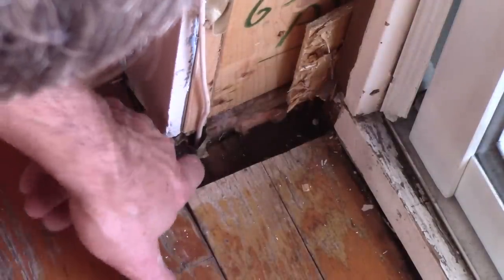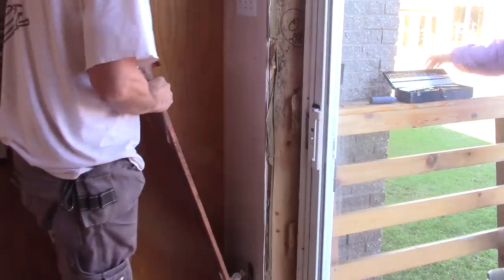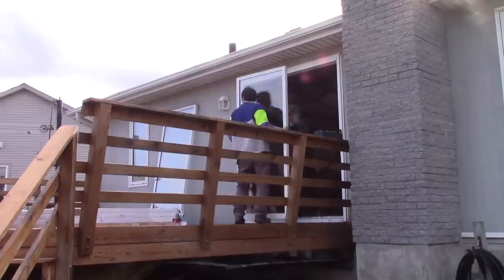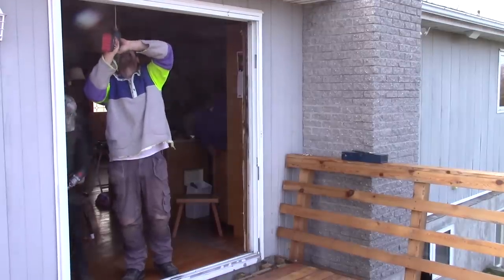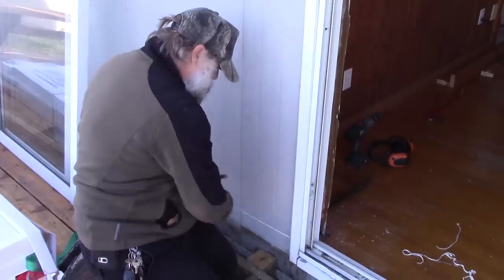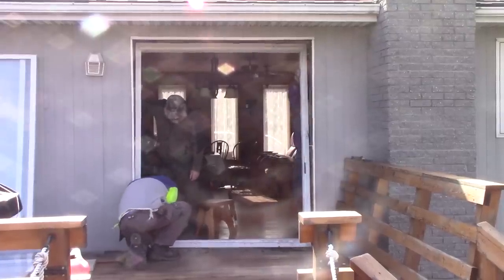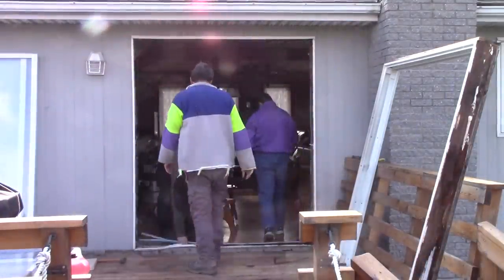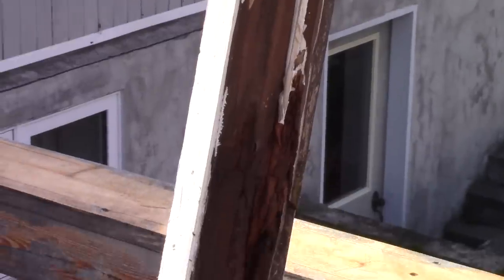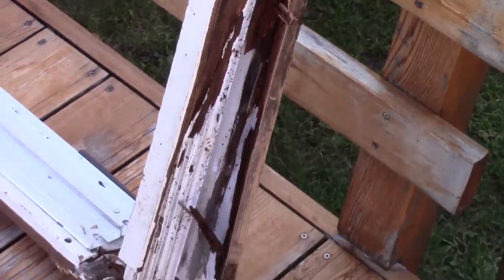There's a lot of rotten wood near the door — I need to fix this. I remove the panel on the wall close to the door, then I remove the doors and begin to unscrew the door frame. But the frame doesn't move, so we decide to cut the caulking that's outside. We try to push and pull as best as we can and finally manage to remove the frame. We also remove the styrofoam strips all around the door. Changing this door is not a luxury — the bottom of the frame and both corners are completely rotten.